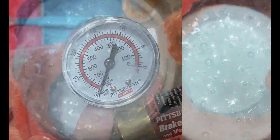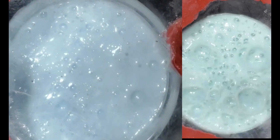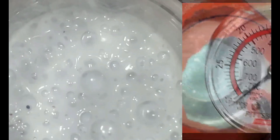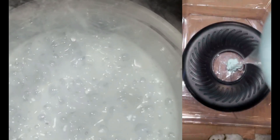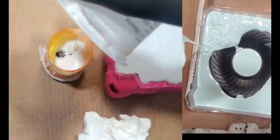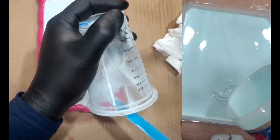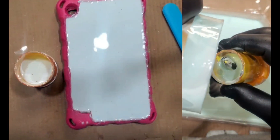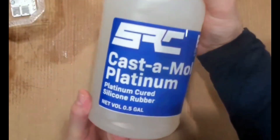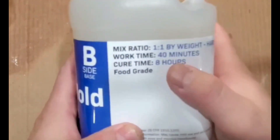Both are thick, so you're going to have to stir them in really good. I highly recommend putting them in the degassing chamber. That takes some time — look at those bubbles popping up. This is a speed lapse video, so as you can see it's going to take about 10 to 15 minutes. Then you begin to pour. You can see pouring over the pour-over mold and also pouring over the encapsulated mold in the cylindrical shaped mold boxes.